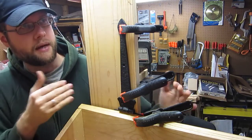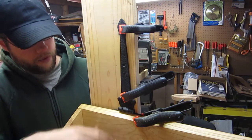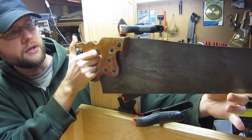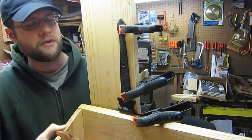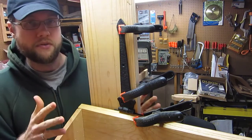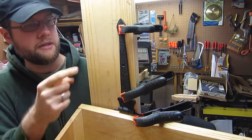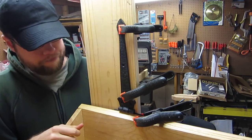The biggest thing is I can move it back and forward easily and kind of see the best place to mount it. I can hold up a big saw because I'm going to want to mount these to the lid eventually, so I want to make sure the hinge doesn't interfere with the saw handle and that everything fits correctly. I can do it very easily by just clamping temporarily in place. Once I have everything positioned perfectly, I'll mark where the screw holes will be and where the mortise needs to be marked out, then do the matching thing on the other side for the second hinge.